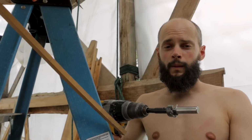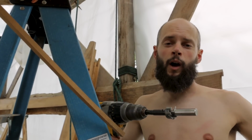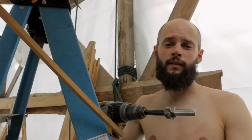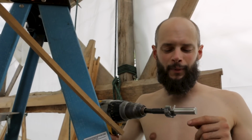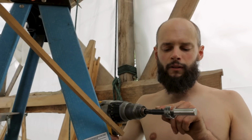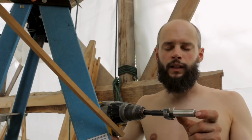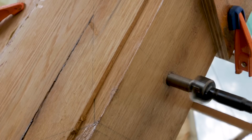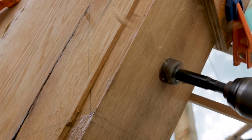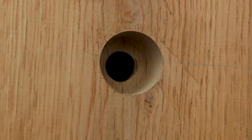The next step after the hole's drilled is to countersink it so that we can put a plug or a bung on the outboard edge, and so that the washer can sit flat against the timber on the inside edge of the boat. And our friend Joe, thank you Joe, has been a big help. He found us these countersink bits made by Milwaukee, and then he made this little stud that goes into it. Normally there's a little lead screw there, and we can put this stud in the hole, and it'll line the countersink up perfectly so that the bottom of the countersink is exactly 90 degrees to the edge of the hole that we bored, so that everything sits nice and flush. So thank you, Joe.